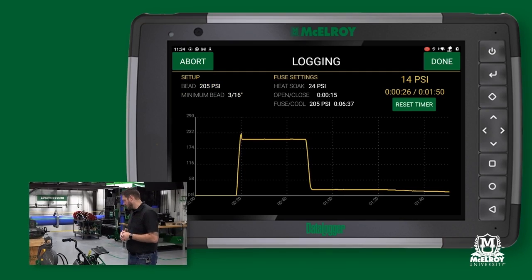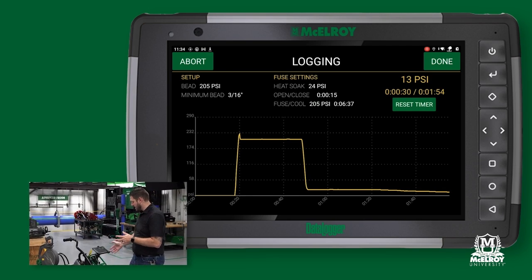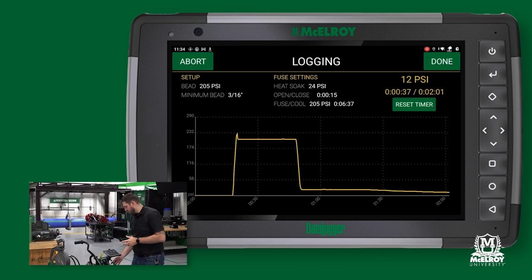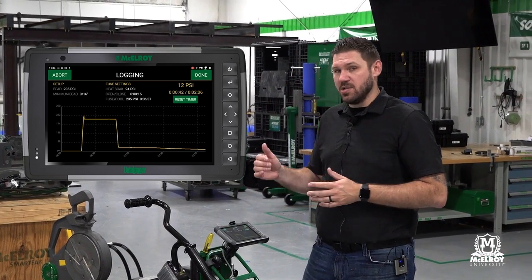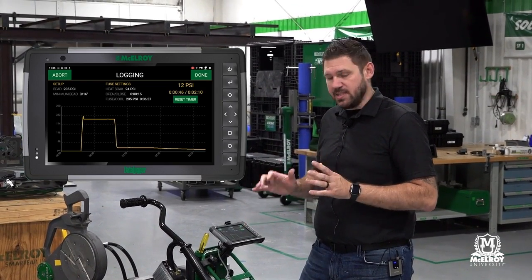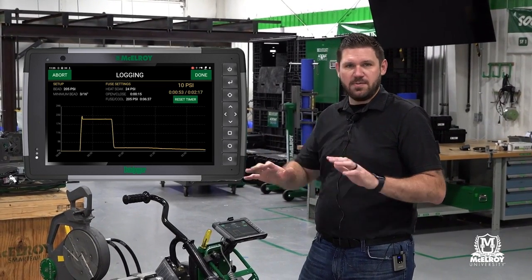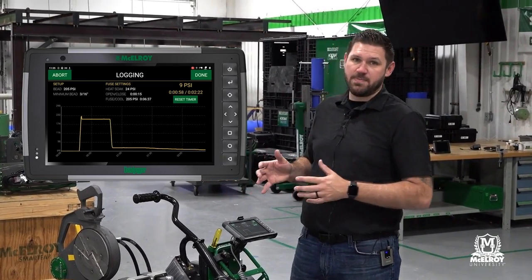We're going to let this go, and you can see when I shifted to neutral — this is a center-blocked valve, so I'm actually trapping pressure into that cylinder and I'm in neutral, so it's not going to move in any direction. What you're going to see is that all valves have a slight leak rate and every hydraulic system is slightly different. What you're seeing is that little bit of bleed-off, but it doesn't have to drop down to zero — it's going to bleed off wherever it's going to bleed off, and that's okay. I just want to make sure I'm not applying any pressure to those pipe ends.